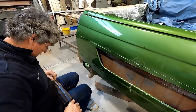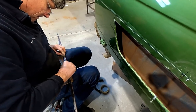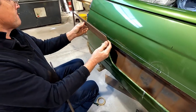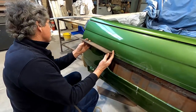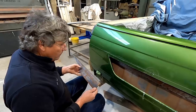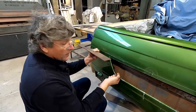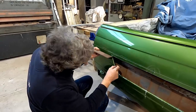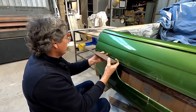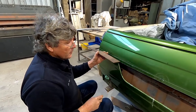Much the same, so we'll just keep running like that. That should give us the face in there like that. All going well. So now we'll do a bit of chopping and we'll make a welder base on it. Now it doesn't matter that this is not as deep as the tailgate because I want to drag this piece of metal outwards. I'm going to have to chock the inside edge up with some small blocks of wood and things like that to actually get it in there, lever it this way, and then we can start working the skin to get the shape in it we want.